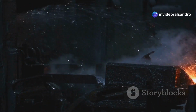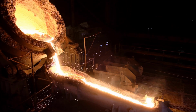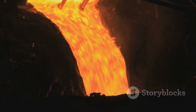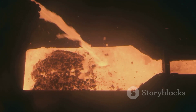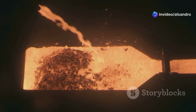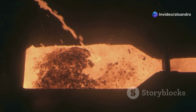First up, permeability. When you pour molten metal into a mold cavity, it displaces the air that was in there, plus the moisture in the Greensand instantly turns to steam, and the molten metal itself can release dissolved gases. All these gases need to escape the mold cavity, and they need to do it quickly and efficiently. If these gases get trapped, they can cause all sorts of problems in your casting. Things like porosity, which are tiny bubbles or voids, or misruns where the metal doesn't completely fill the mold.